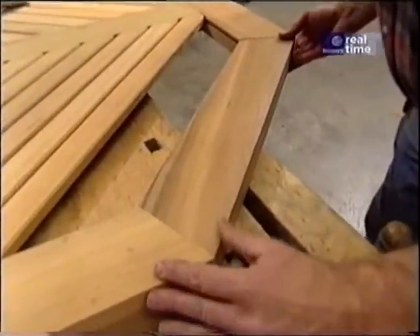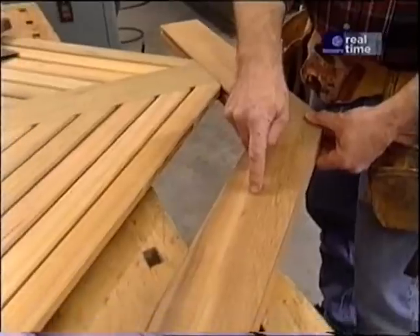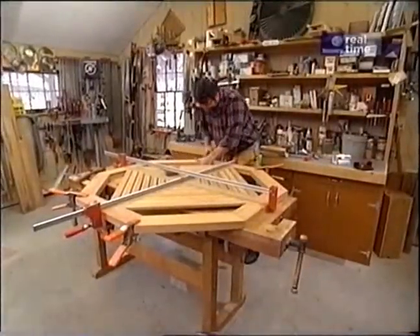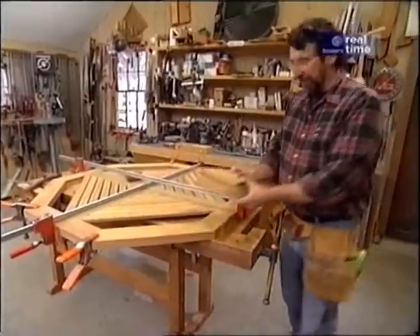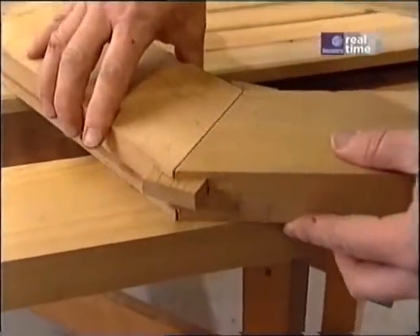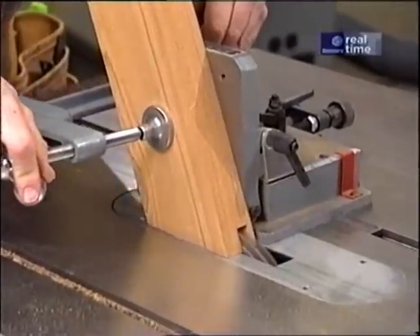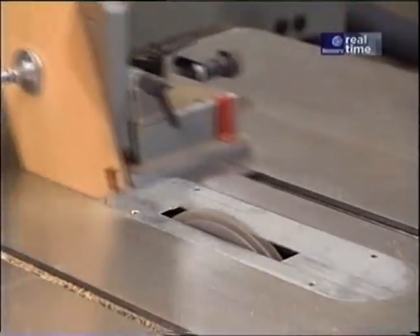Sliding the piece in — that joint's good, the inside's even, and the same is true on the other side. Now I can use this piece as a template to cut the remaining seven pieces. The next step is to make a groove at each of those joints for a spline that's going to hold the pieces together. To make those grooves I'm going to use my tenoning jig, which lets me hold the piece vertically as I run it through the dado — clamping the piece in place so it's safe to push it through.